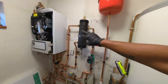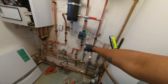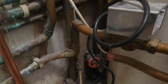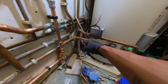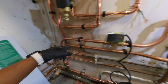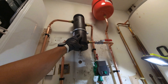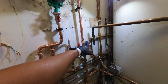It's taking a lot longer than initially imagined, which is always the way with a job like this. We had a leaking pressure gauge that wasn't needed so we had to drain part of the cylinder down. The hot side has been done — doesn't look pretty but that's the best way we could connect given the bend that was there. The hot is now all linked out. Filling loop is done. Then we had a hiccup — the pump I was given was the wrong one, way too big. Sam's gone down to City Plumbing to get the correct light commercial pump. In the meantime, the boiler is fully piped up — flow, return, and gas all done.